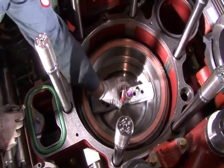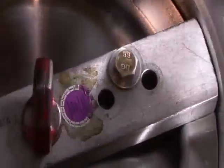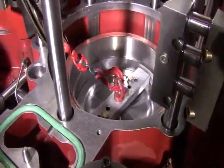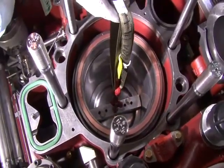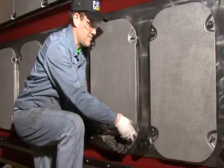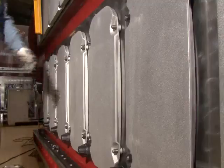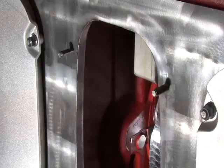A lifting device is mounted onto the piston crown. The piston is turned to bottom dead center. At this position, the shank division of the connecting rod is accessible through the crankcase doors. The crankcase door is removed from the engine block. The crank chamber is now accessible for dismounting the piston.